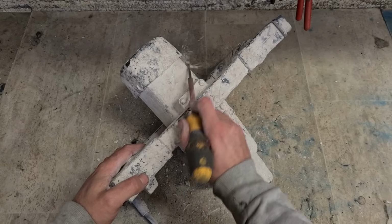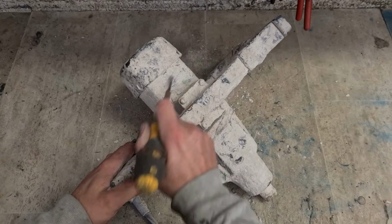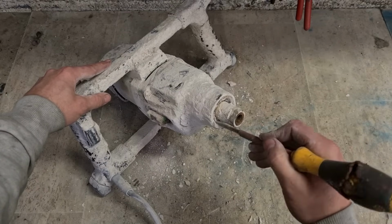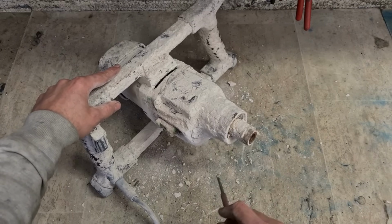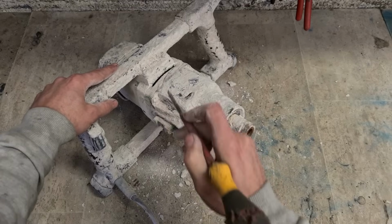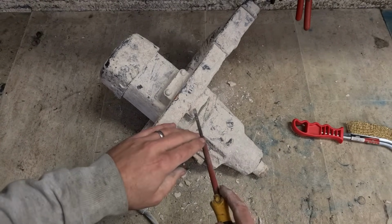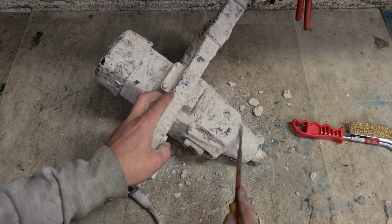You can clean it down as much as you can, but don't get bogged down on it. Most of it will scrape off. Scrape it off with a flat brush, or else get a wire brush. Take as much as you can off. You're only just reducing the width up here, but you do have to clean out the bore for this bearing down here. That's the main important one. Plus all these bits, you can knock that off, just simply because whenever you're rebuilding it, it's less likely for this to break off again and get onto the gearbox when you're reassembling. So basically, before you start stripping, get cleaning. Clean off as much as you can, the main bulk of it. It doesn't have to be spotless.